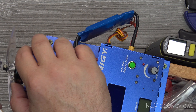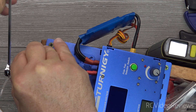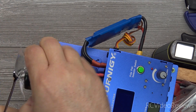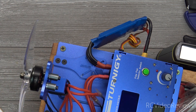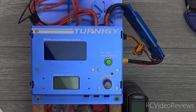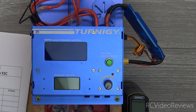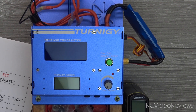For my calculations I'm using an estimated all-up weight of 673 grams. What I did is I weighed the chassis and the frame, and I looked up all the values on the other parts like the motors, the flight stack, and the props. I didn't weigh the GPS or the receiver or the Bluetooth module — those are marginal. And I didn't include any superfluous items like tapes and glues. So I'm looking at 673 grams as an estimated all-up weight for this one.